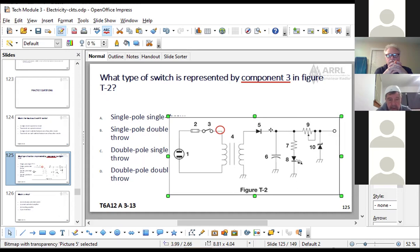So after this, what do you think the electricity looks like after it passes through the diode? Single wave rectified. Okay, it's not going to go zip, zip, zip, zip. It's going to go bump. It's going to ignore that bottom cycle, then bump, bump, bump. Now, the beauty of this is that for each bump, it gets charged up and stores the electricity. When there's no voltage, it contributes the electricity back. So it's not going to be totally smooth and steady, but it's going to be sort of closer to direct current than you'd expect. DC, yeah.